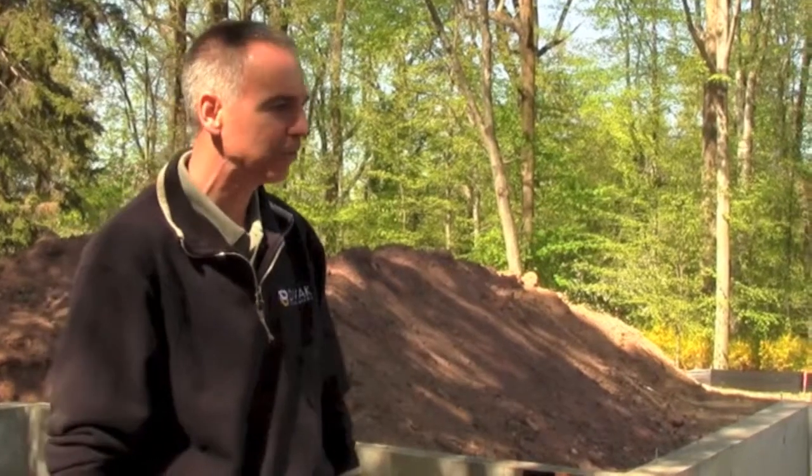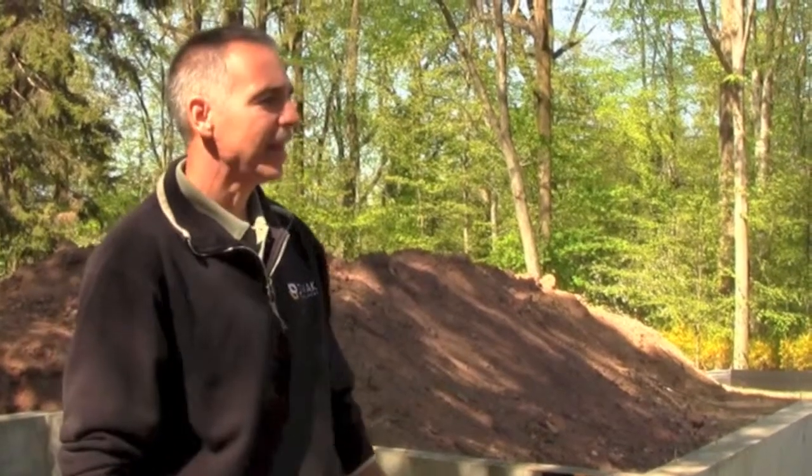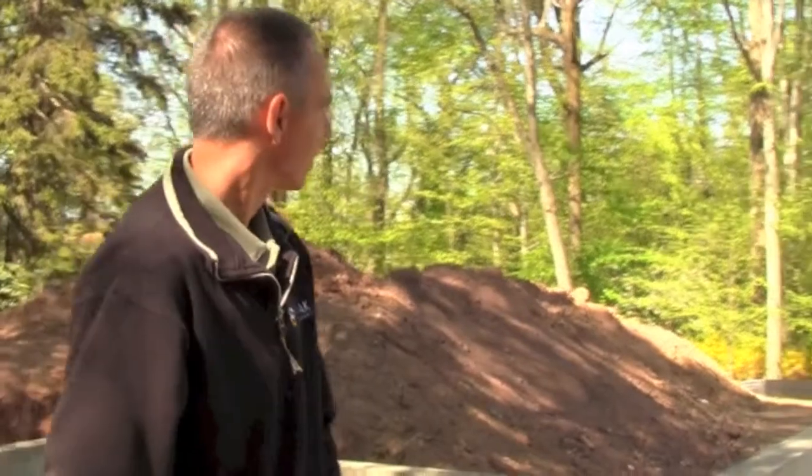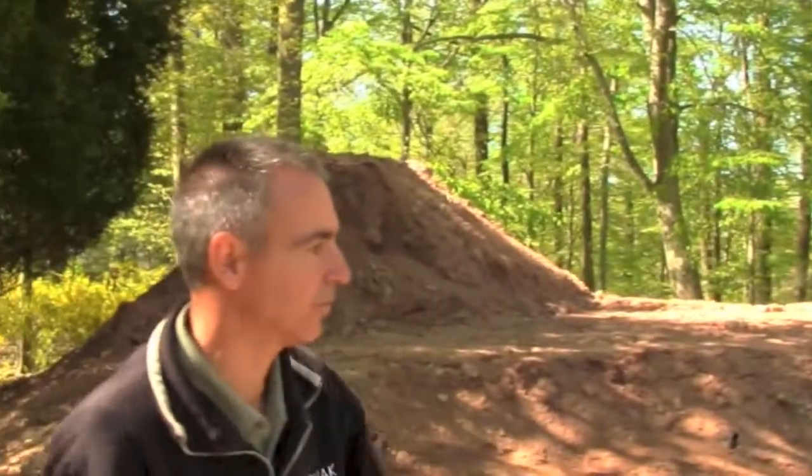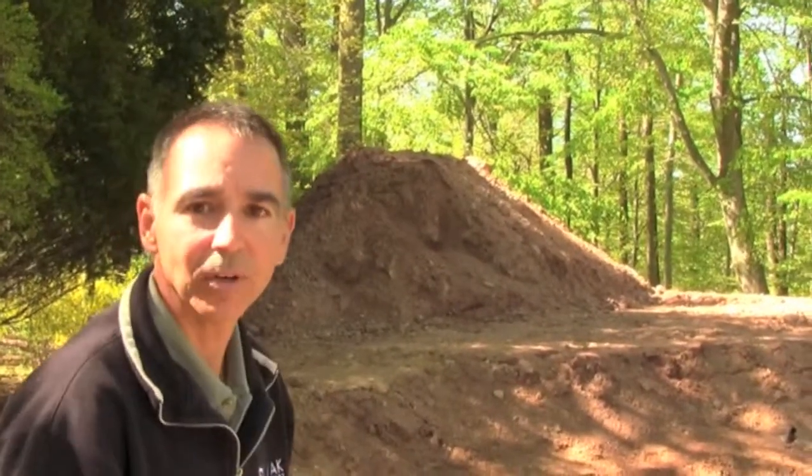We need to locate our foundation, make sure that our foundation is right. So the engineer comes out here, he'll shoot the height, make sure our ridge height is going to be perfect and our height of our first floor is perfect, just like on the plan. And then they'll give me a letter saying that I'm in conformance and everything is great. So I give that to the town so they okay it, and then we can start framing right away. Let's take a walk over here, and I'll show you exactly what I mean by marking out all of the heights for the spray. Okay, come on.